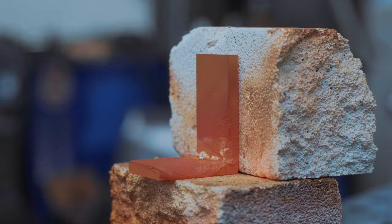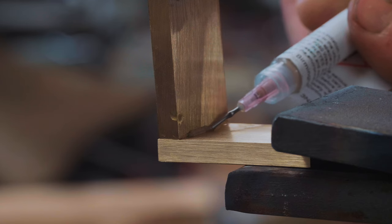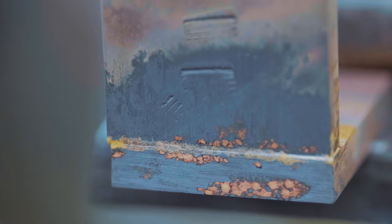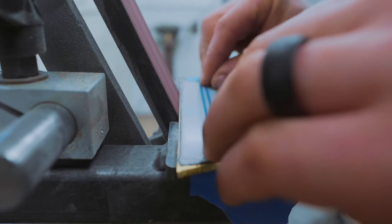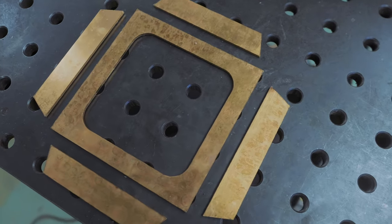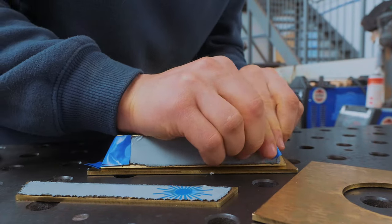Oh no! I couldn't get the silver solder to flow without the brass melting, so I moved on to trying my solder in a syringe, that is a jewelry solder, which actually worked fantastically. It flowed the whole way through and left us with a really strong joint. The trouble is, when we got our brass parts out, we mitered the angles on the 2x48 belt grinder. We set it up on the plate that it's to be soldered to. We found that there was no way to fixture it and get the solder to work.